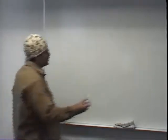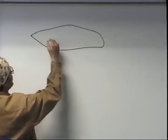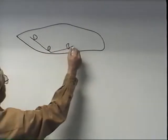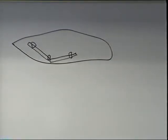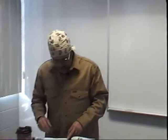Fixtures also provide more consistent quality and reduce production errors by being accurately identified. A simple example: you might put small tabs on a tabletop at specific locations, lay a piece of steel against those tabs, and you'll have an accurate corner every time. That's a basic fixture — it holds your parts in place while you're making the fit-up and weld. Read about weld fixtures; there are three bullets coming from the items I've already spoken about.